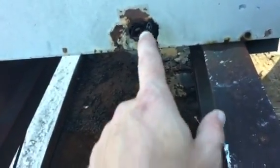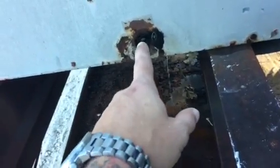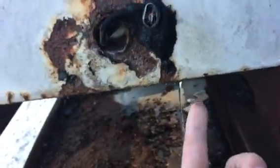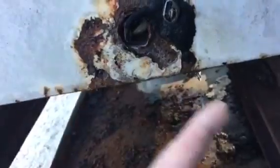We need to get these things sealed out, and I would even look into this as well, because what's going on here is there should be a PVC p-trap — that's what it's called — directing the water from the inside out. Instead, this water is literally coming out of the bottom side of the unit right here.